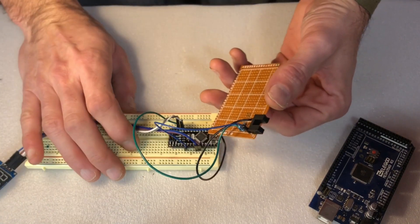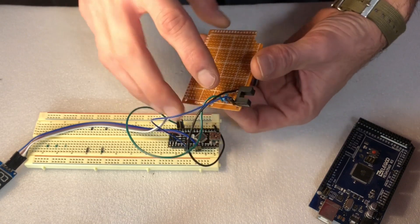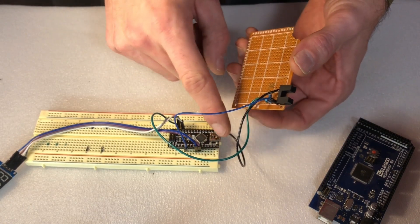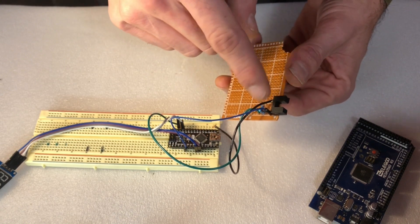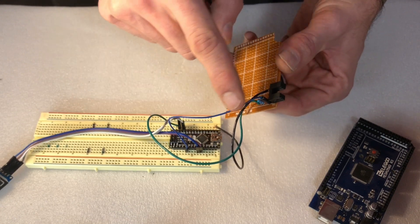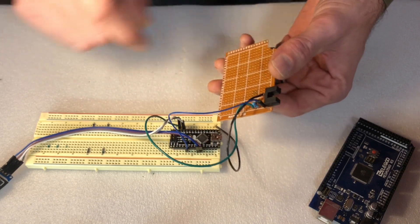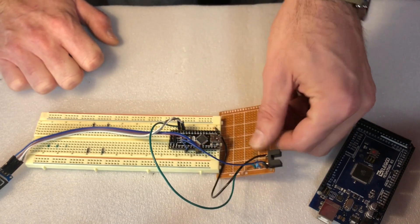Now this is the first time we've ever used an Arduino, so just bear with me — it's not that bad. I'm basically feeding in 3.3 volts right here to this opto interrupter switch. It's going through the circuitry and then coming back out, going to a ground right here. And then it's taking a signal wire off of this and going to pin 2 on the Arduino board. I'll go through the schematic on this where you can see how that works.